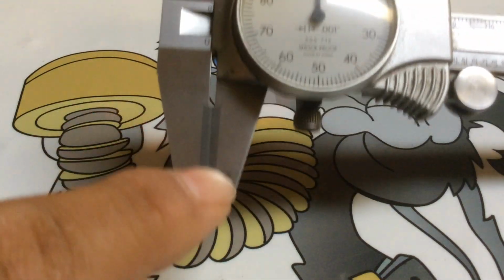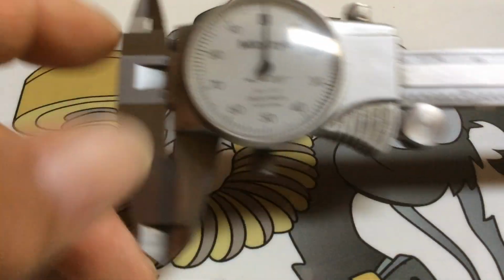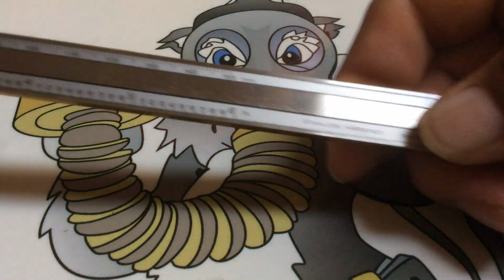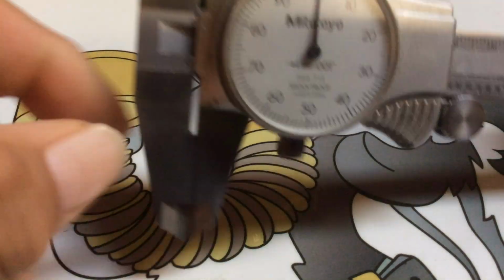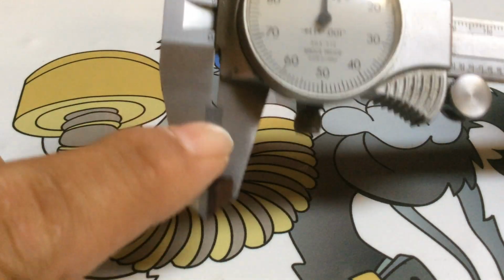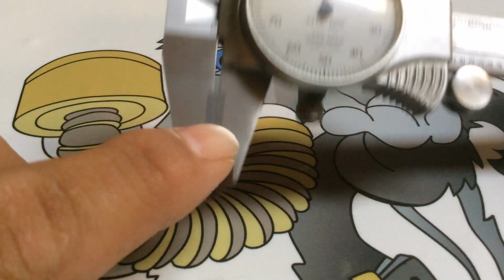Now, when they wear out, you adjust here. What they do is they lap them here. But if they don't fix this, or your depth, the caliper is really no good. See, that's why I used to buy them by the 10 pack, because this wears out the most, because this is what you use the most. You have to lap this in there.